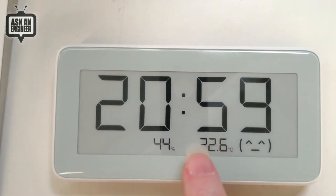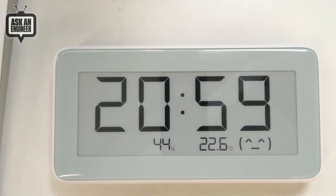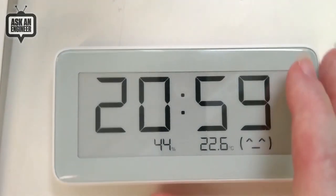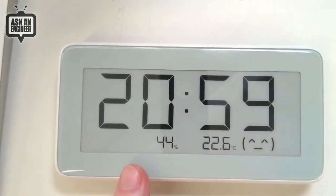Inside, it is emitting the time, I think, definitely the humidity and temperature over Bluetooth as data signals. And so a lot of people who have an ESP32 using Home Assistant or even using our code with Blinka or Circuit Playground, you can read the temperature and humidity that's being sent from this board on your Bluetooth controller. So this acts as a peripheral, and it's not an advertisement. You would connect to it and you can read the data, but it's a very nice all-in-one, not only a clock that runs for quite a long time, but also a sensor node.